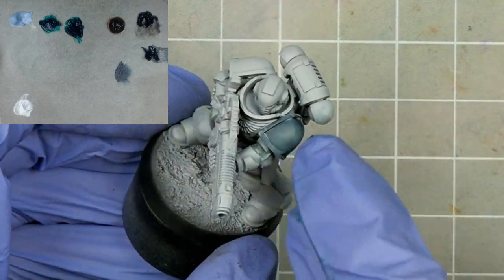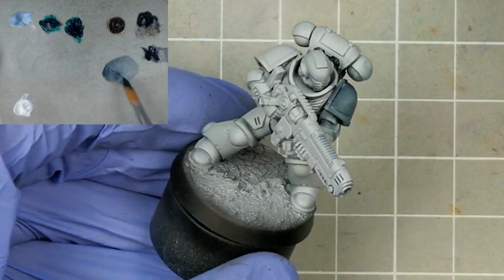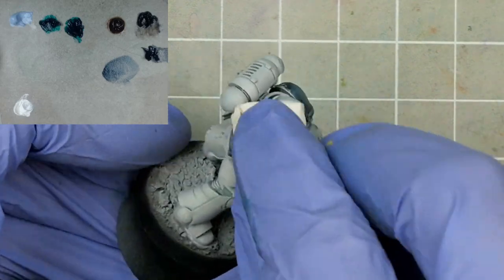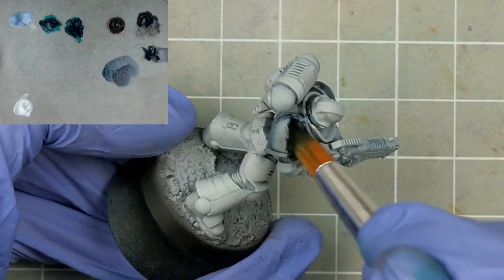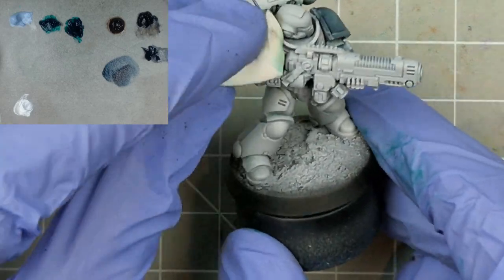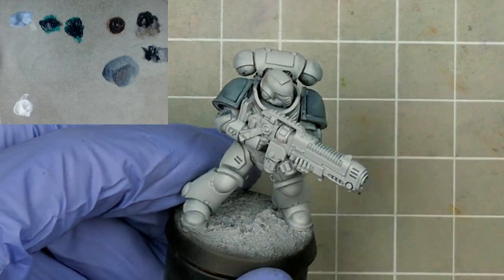The stain would be even stronger if we let it sit for 5 to 10 minutes, so keeping your paint thick is one way to maximise your staining potential. Conversely, if I add a brush load of thinner, you can see that even though it gets in there more easily, it's much more transparent, and if I wipe it away, there isn't much left behind at all. Now let's meet it halfway, layering on thicker paint - we're left with a stain that's somewhere in between. With your pre-glaze, you'll want to find a balance between paint thickness and ease of application.